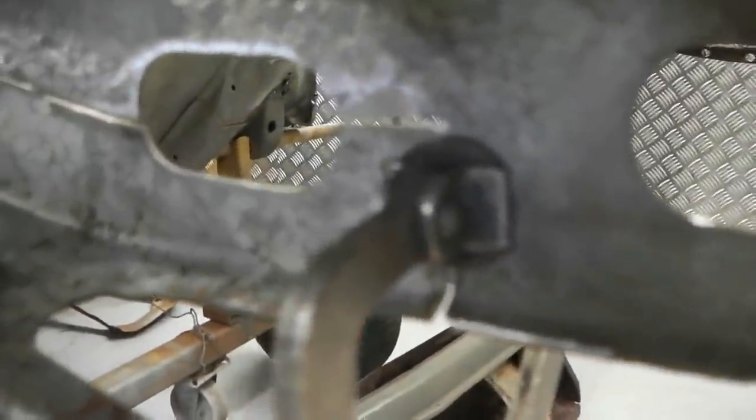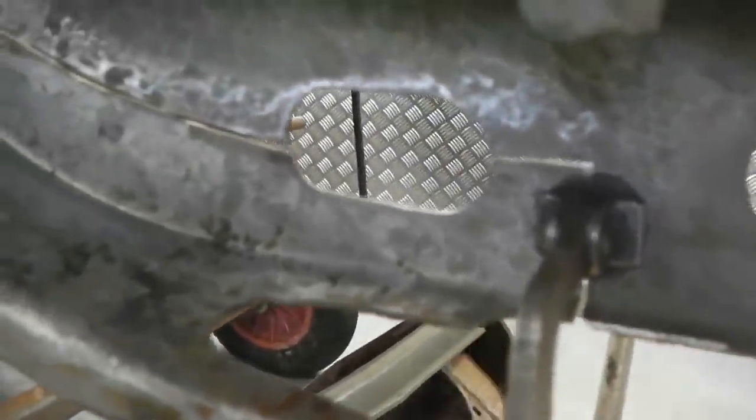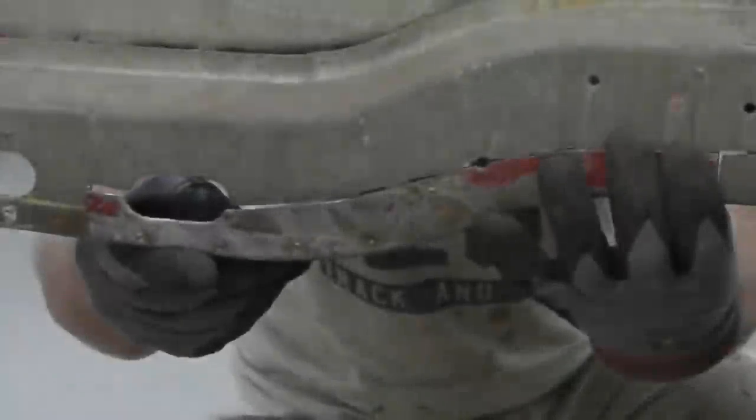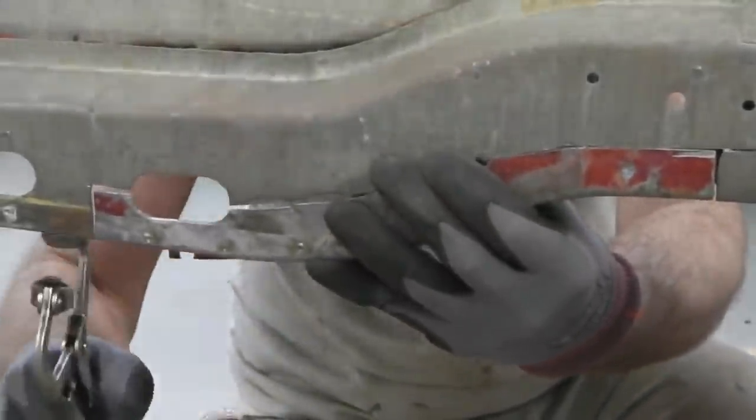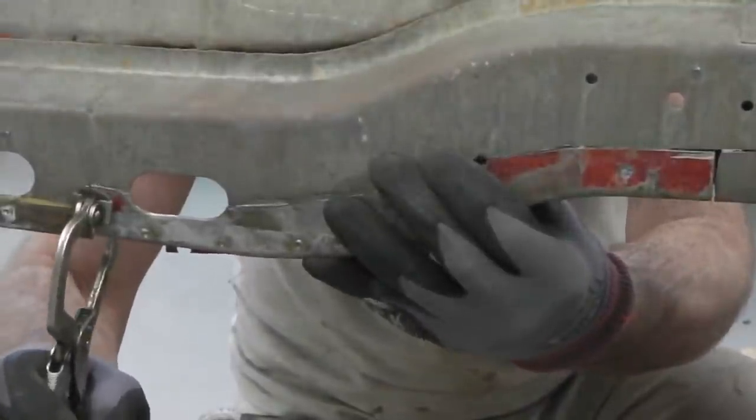Gloves are on, and then using those jaws, then lock the profiled piece of donor metal. We took our time making sure that cut was right, so that when the welder comes in, there's less work to do. Lined up, because that section was damaged. If you looked on the previous video, needed a whole piece replacing, really. It was pitted. So, from the other side, grip that.